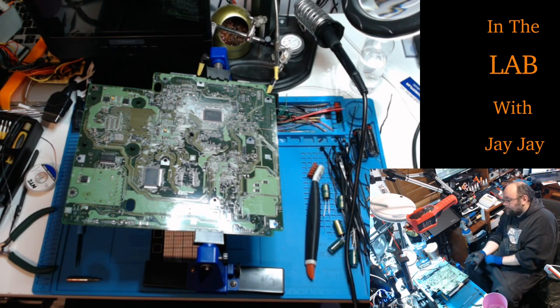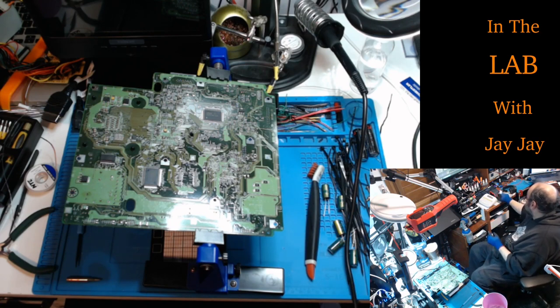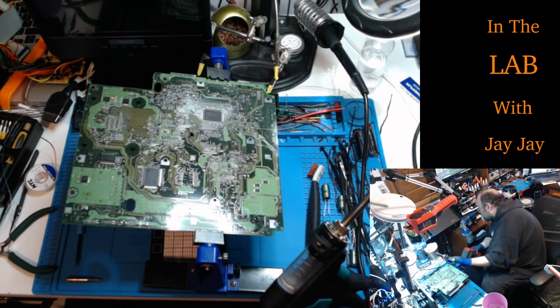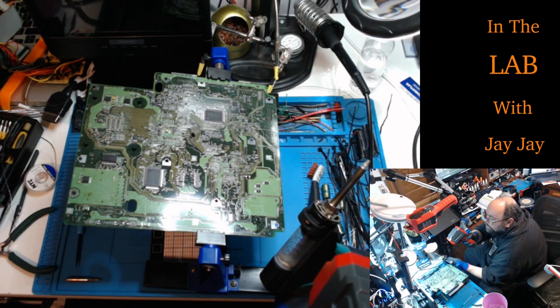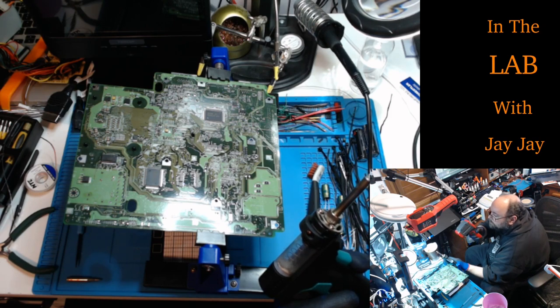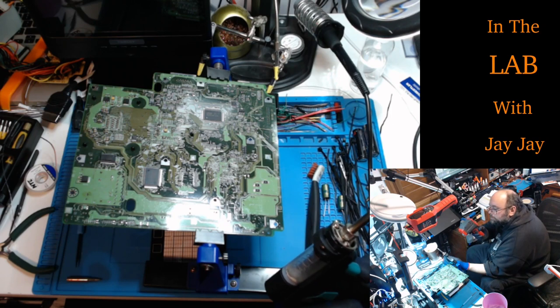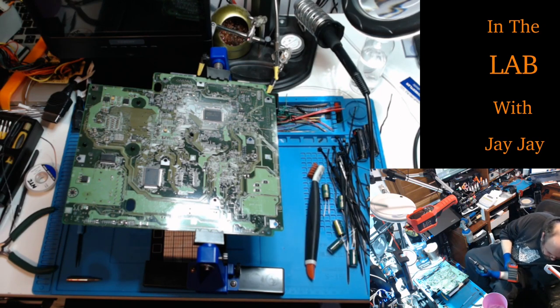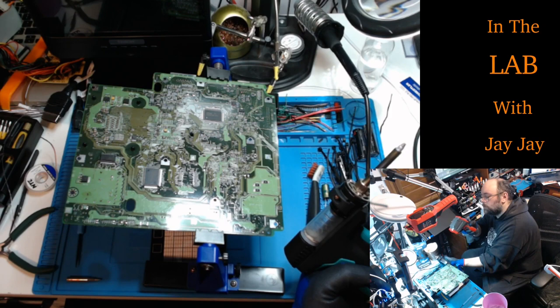Well, it says it's at 350, and it's got a temperature sensor in it. So let's have another look at it, huh? Yeah, 150 it says. It's set on 350, but it's only up to about 160. Yeah, alright. Well, 160 is not really hot enough to melt solder. We really need it to get up around about 180. So it's at 170.